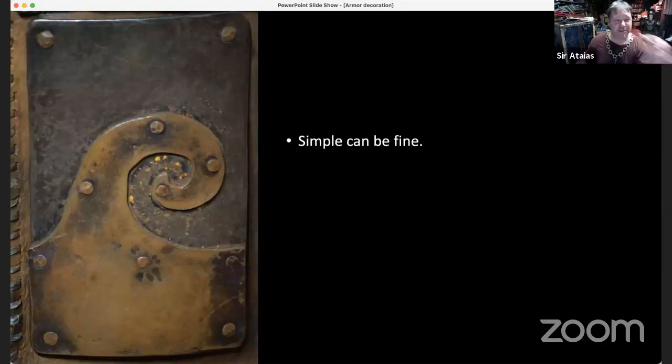So this is one of the simplest things that you can make, just a simple silhouette. That's the background metal, steel that I gun blued. As you can see, I've let this go, so I may want to polish it up. And this is a piece of copper that I cut into the wave pattern, held on with copper rivets, actually copper nails. Those are slate nails, is what they'd be called at the hardware store. They're not the ribbed copper nails. They're slate nails, so the shank is smooth and straight, and doesn't have any indentations on it.